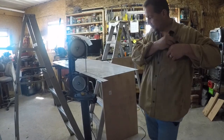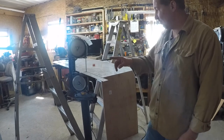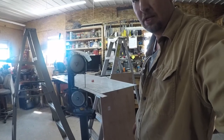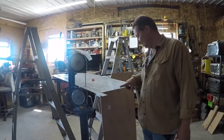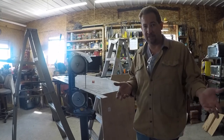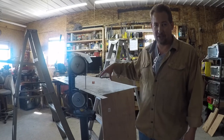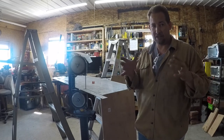So now the next thing that's going to happen — I'm going to go ahead and cut out 1, 2, 3, 4, 5, 6, 7, 8 strips. They're two and a quarter inches wide. And then I'm going to leave the center section, which is about six inches wide or so. I'll leave it for custom type deals, one-offs. The other day I had somebody ask me for a big honking ULU-sort of knife — that's what you leave that center piece out for, so you have something for custom sizes.